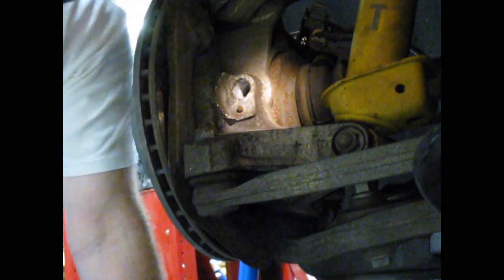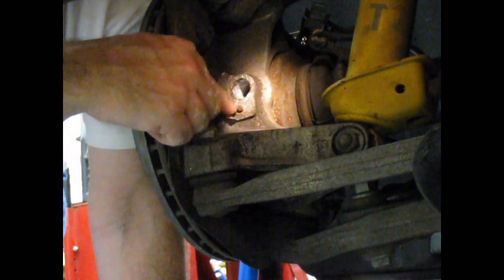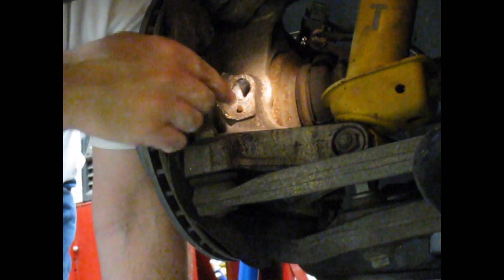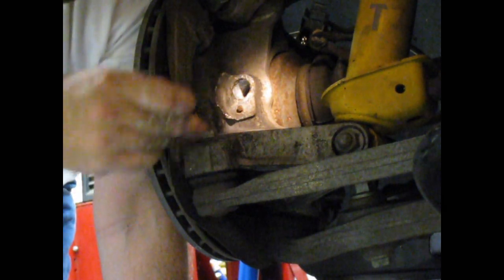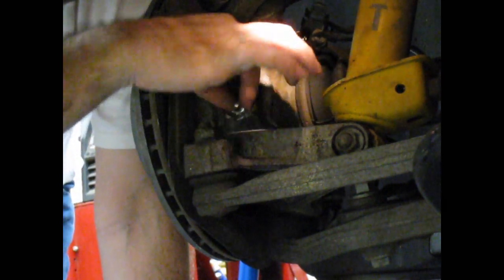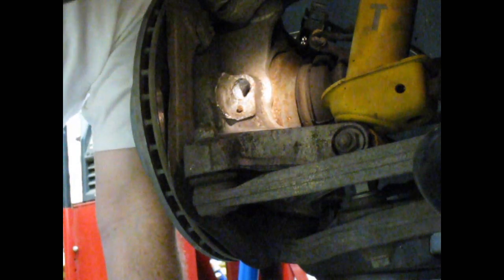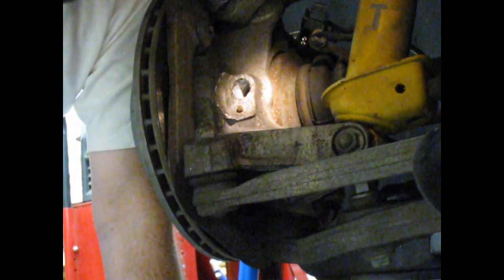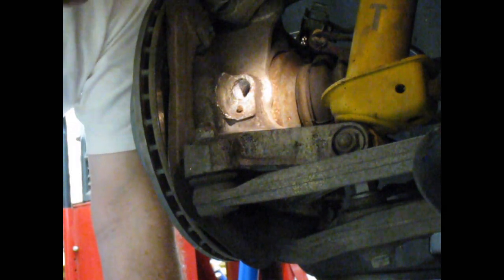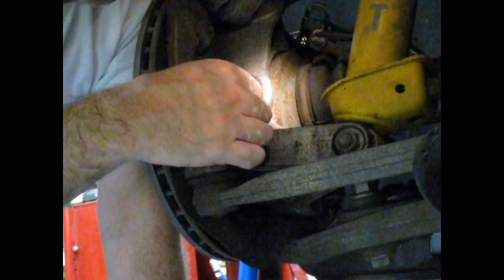So what I'm planning to do is with my welder, I'm going to build up a little weld on top of this bolt piece that's sticking in it. Again, this is steel and the carrier's aluminum. I'm going to take a nut and weld it onto the end of this broken bolt, hoping that the heat will help break the corrosion bond, and then once I have something stronger to grab onto, I'll be able to unscrew it. We'll see if this works.